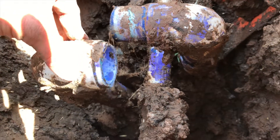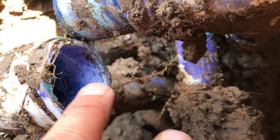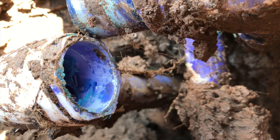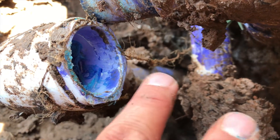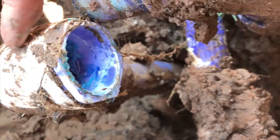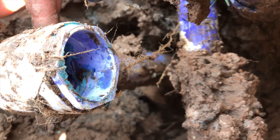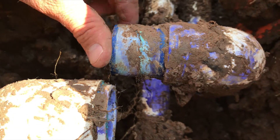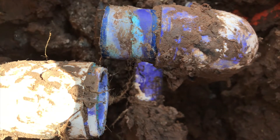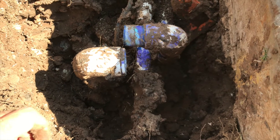And you know why it's blown apart? You can kind of see it really wasn't primed all that good, and it was not hardly welded at all. When you use solvent welding, it actually fuses the pipes together. You can see a little bit of this weld right here — I'll show you better when I cut this out. This fitting had blown apart. It didn't break or anything; it was all the way up to here, but it just wasn't fused good.